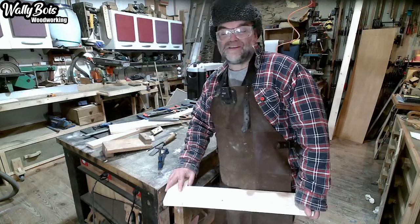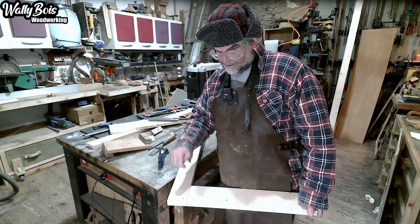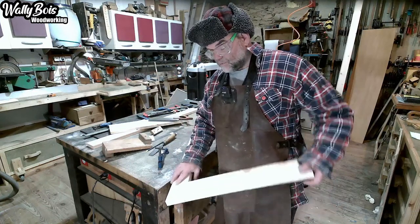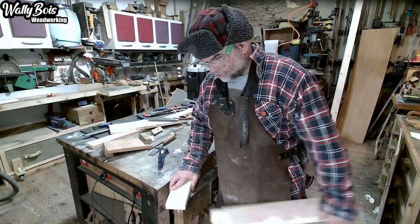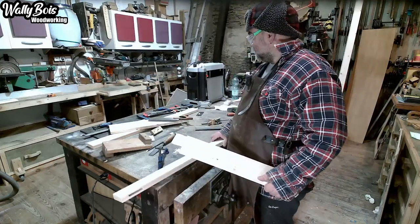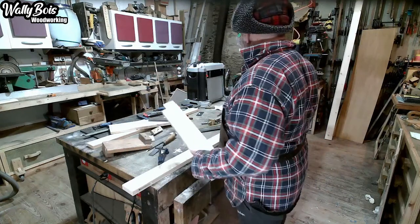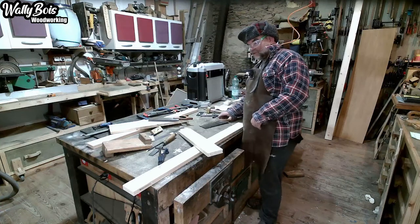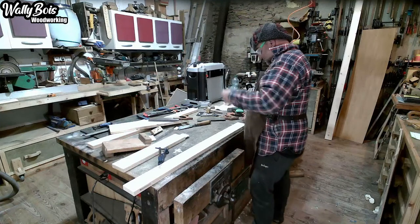All too often, and I've done it myself loads of times, to be honest, if I feel it doesn't matter too much, I'll stick my drill straight through and whack a peg right through. There's a problem with that as well, because you can get breakout from the opposite face. So that's our first joint. And I've got to think about the second one. I was going to do it over there, but I might actually still do it by hand, because that worked out quite nicely. Don't take long, does it? Once we know how, it doesn't take long. So, should we do it by hand?